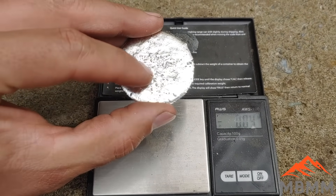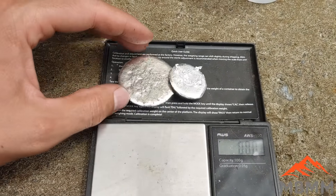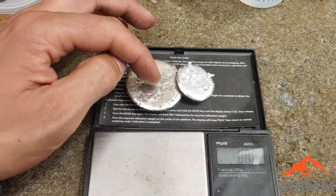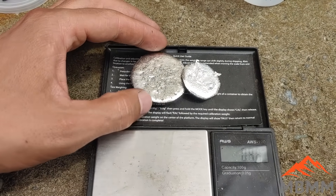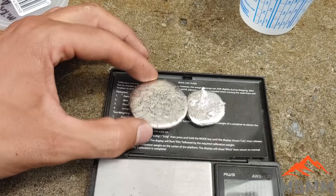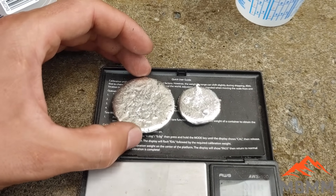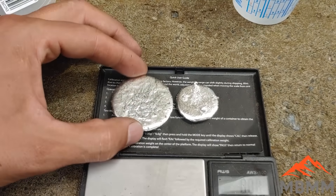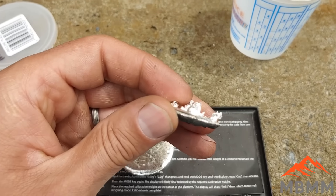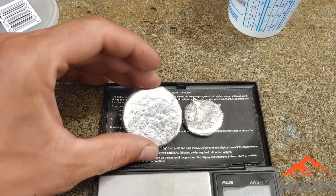What I'm going to do now is take the two buttons, combine them in a crucible, mix in about 50 grams of borax, melt the silver down into one single button, pour it into the cone mold, and we'll get a little pure silver pyramid. One other thing while I'm standing here — I've got this one that has little silver sprouts, and this one does not. The way I prevented them on this one was to cool it down very slowly in the furnace. I stepped it down about a hundred degrees at a time and let it equalize at each temperature, and that way you can get the oxygen out slowly rather than having this explosive texture on it. That's how you refine silver without those silver sprouts.